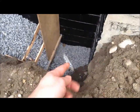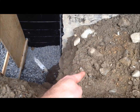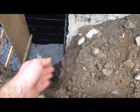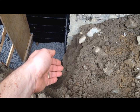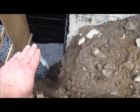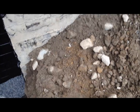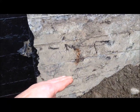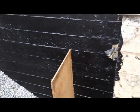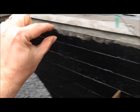So we'll go down, we'll take out the drain tile underneath this. We'll patch up the cement holes that were going into the foundation with cement. We'll lay a new bed of crush, take out the old crush which was really no good and subpar, put in new crush about an extra foot. Lay the landscape fabric down, build the crush in here and then put in another layer of topsoil.